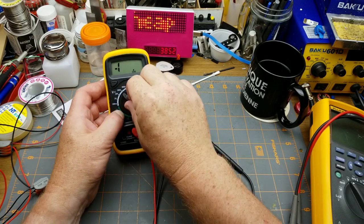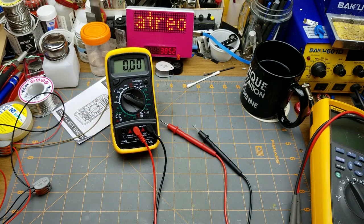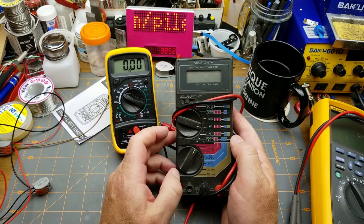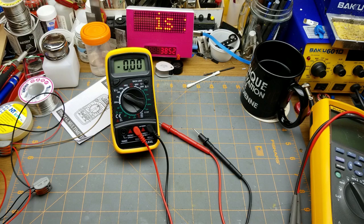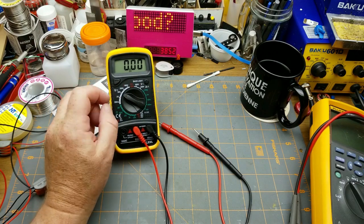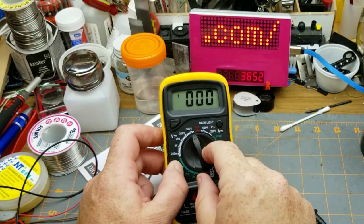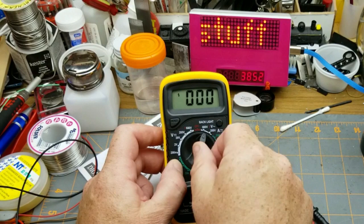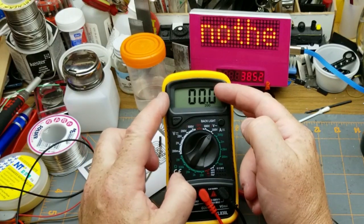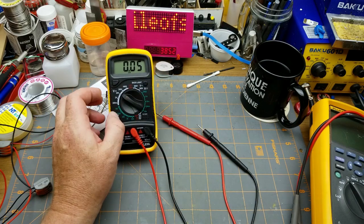The first thing we ought to do is turn it on. It's a manual ranging meter, which is fine — most of the cheap ones are. My ancient Radio Shack meter was manual ranging as well. I'm not going to pull that one out because the last time I tested it, it proved to be inaccurate — which explains the failures of a lot of my youthful projects. On the 20-volt range, it shows the name of the range on the screen, which is really handy. On the high voltage range — 600 volts — it shows a little lightning bolt, same thing in AC mode. It's not showing you that you're in AC mode specifically, but it is showing you the range.